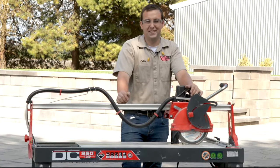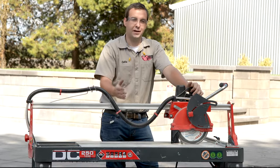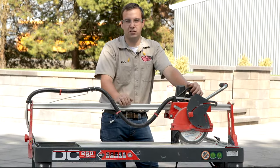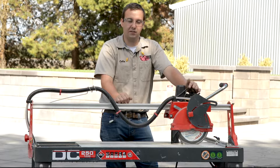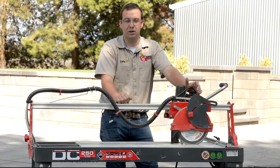The fifth option for cutting a paving stone is the use of a tile saw. This is a pretty large and intricate tile saw — there are a variety of different types. The main thing is this is a saw that uses a 10-inch blade. You can get an abrasive finish or a regular finish; as long as it's a diamond blade, it'll efficiently cut through a paving stone. It's pretty fast, cuts very clean, and it probably wouldn't cost you a whole lot to rent from a tool rental yard.